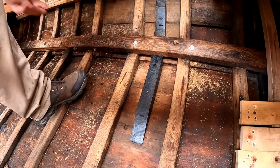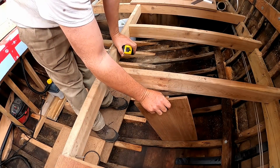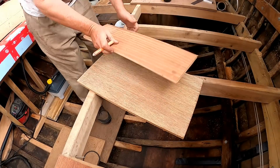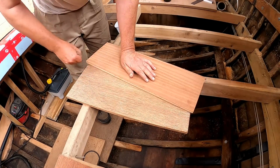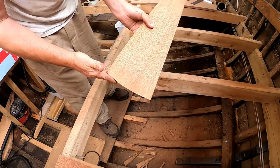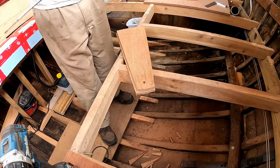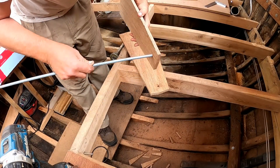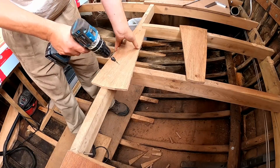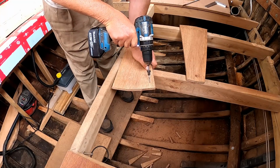Let's go. So I'm going to start with 2 support plates. In other words, that I can affix to the side of the frames that will hold the axle, the shaft. So let's say good. A bit of a curve at the bottom and a bit of a curve at the top. Okay, let's make this even prettier. Okay, so the pivot is going to be this gnarly bit of 3/8 threaded rod, and the router will swing on that. That's the plan anyway. Down on the other end, let's put a whole bunch of countersunk holes to attach screws to the frame.